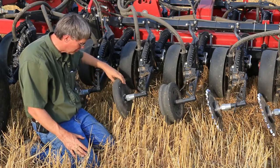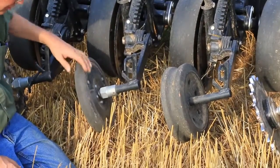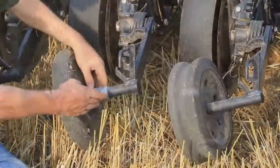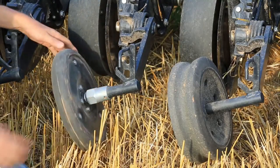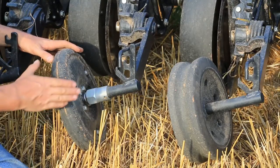This is a 2 by 13 inch smooth wheel — two steel wheel halves. This one is actually working pretty well in what we consider to be looser soils or medium moisture soils, and it works quite well in those environments. We've found you have to set it at close to maximum angle, which is when the set screw is pointing straight backwards. This wheel assembly works really well in looser soils and medium moisture conditions.